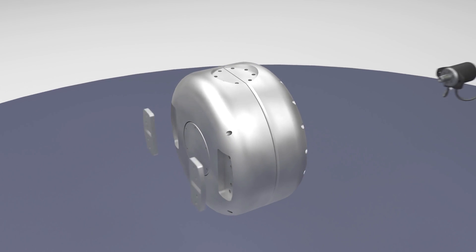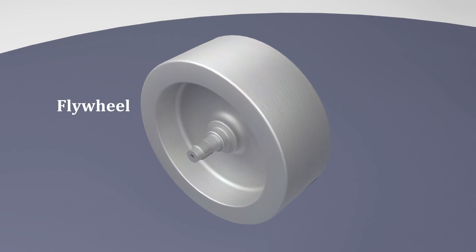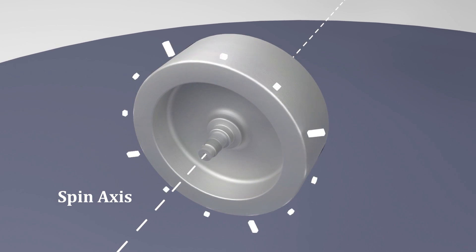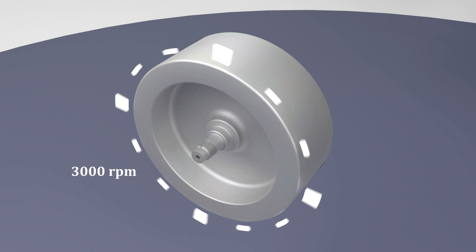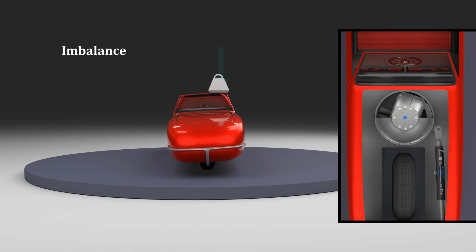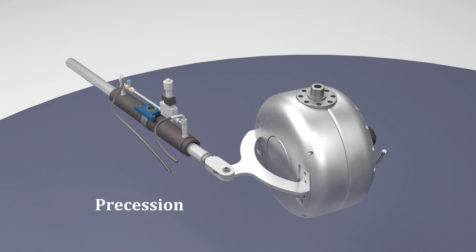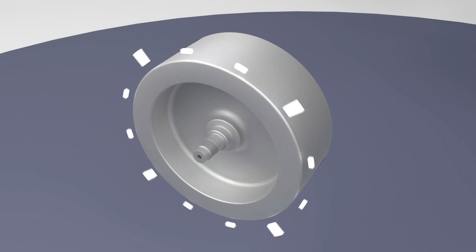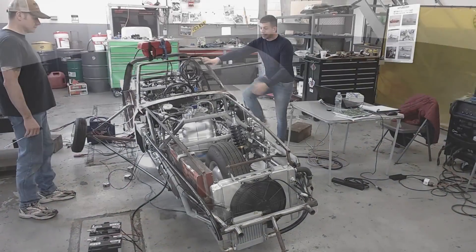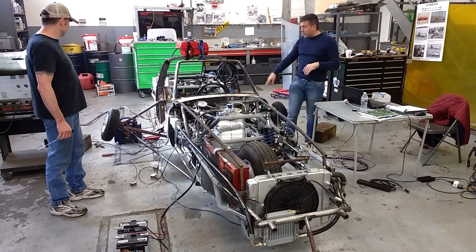The magic of the gyro is in the stored energy available for work. This is known as kinetic energy. The mass of the flywheel, the diameter, and the speed at which it rotates determines the amount of stored kinetic energy available for work. When the control system senses an imbalance in the vehicle, the precessional cylinder is activated, resulting in the precession of the flywheel. The kinetic energy stored in the spinning flywheel, with the rapid precession of the flywheel, produces torque. The torque is then transmitted into the vehicle frame, resulting in the correction of the position of the vehicle.